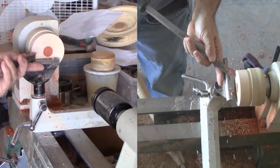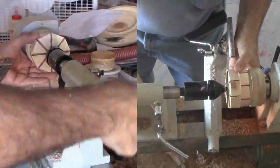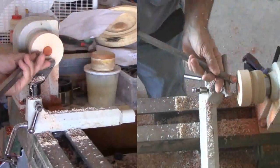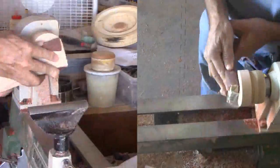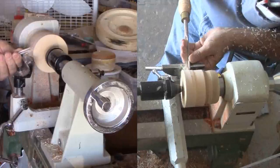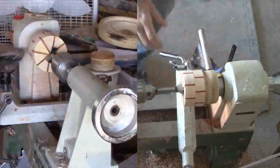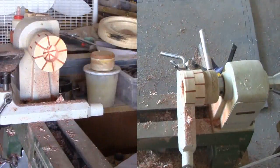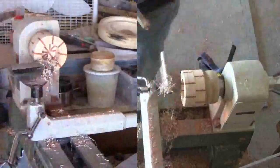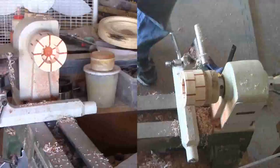With this segment prepared, I'll true it up again, then glue on another ring. Then layer by layer, follow the same process: first trim the circumference of the last ring, next trim the face just a little, then drill out the top ring with the Forstner bit. My largest bit is 1⅜ inch, but I need a 1¾ inch opening, so I'll ream out each segment and test it with a 1¾ inch plug I turned. The interior will vary a little as I build the case.